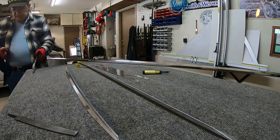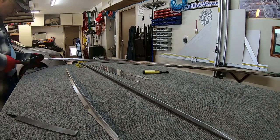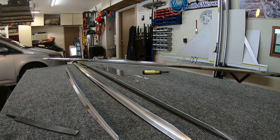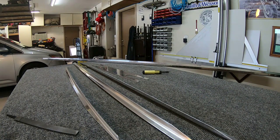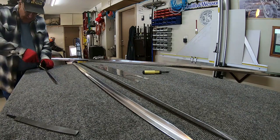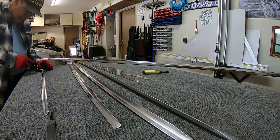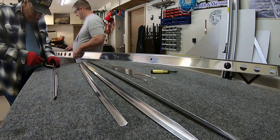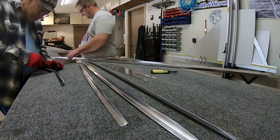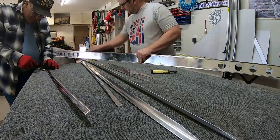He was filing with the file, and I figured I'd grab the pieces and go do them on the deburring wheel that you get from the kit from Cleveland Tool. It is a lot faster — that deburring wheel is phenomenal. It is so phenomenal that I actually purchased the one-inch version of it to hook to my air die grinder to do the inside holes of the ribs, and also the inside edge of the ribs. I'll show you guys that particular tool in an upcoming video. I highly recommend those one-inch ones — they're great for getting into areas where you normally couldn't.